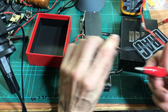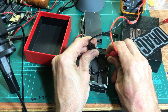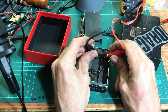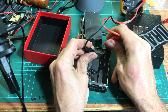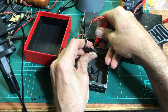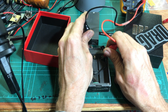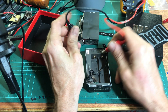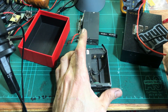We'll go across these and confirm — yep, they've got continuity, so that is indeed the cell series connection. Now measuring back to ground — no, so that's going to be the same. There's no shorts from these contacts back to ground. So that's good.